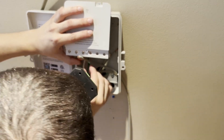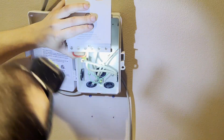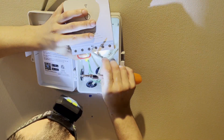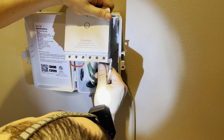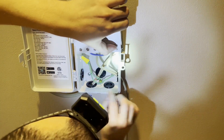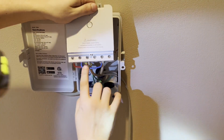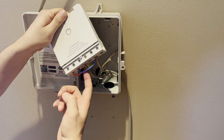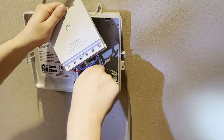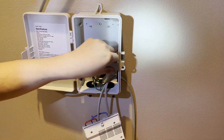These two are going to be together. Let's tighten on the L — make sure the connections are good, nothing you can pull out. Always make sure you do this without the power on, obviously. So it's going to be common two and then the blue jumper is going to go in on that one. Power is coming in, got the ground, common is jumped to end to give the timer its power. There's a little bit of wire hanging out of the bottom for the jumper, which is really good — if you're doing electrical tests you can put your probe leads on there and get a good reading.